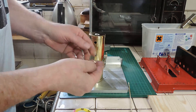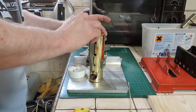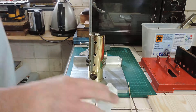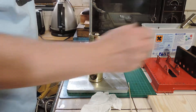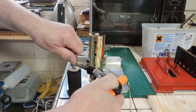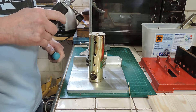Pop the ring of solder around the boiler insert like that, then place the boiler insert with the ring of solder around it in position. We're pretty much ready to go — just need a little screwdriver. I use one of these kitchen brazing blowtorch things; the igniter's gone on it so I'm using another torch to ignite it. You don't actually have to get this too hot.